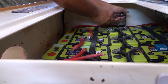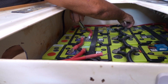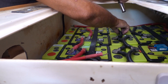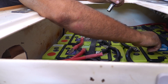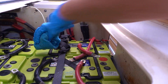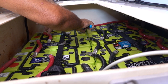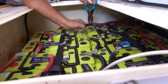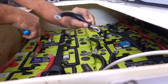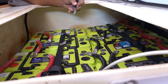One of the reasons I think these batteries are getting too hot is there is no air space between them, and there needs to be a quarter-inch air space between all the batteries. There's room up here but I can't see the bottom — if there's room I'm going to space them a bit. This one you can see is one of the badly corroded ones — that is an issue. Looks like we've got rust, sulfation, all kinds of good stuff. Let's go clean it up.